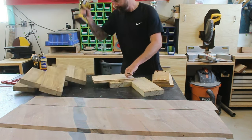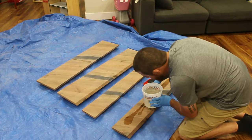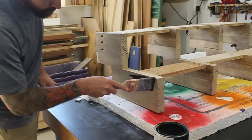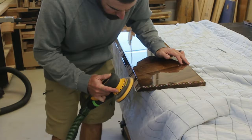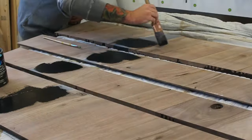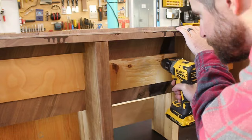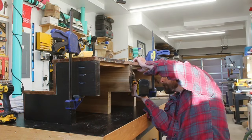I can head back down to the basement for some more epoxy — this time a glaze coat. I'll make sure to let it run down the edges of the parts that will be visible. While that's curing, I'll paint the outside supports so there's no taping off needed later. Last bits of prep are sanding the mitered edge and the drips from the underside, and painting the underside of the epoxy black since I noticed I could see through it a little — I didn't like that. Now it's just a matter of clamping each part into place and driving screws in from the back, making sure not to put any screws directly into the epoxy river.